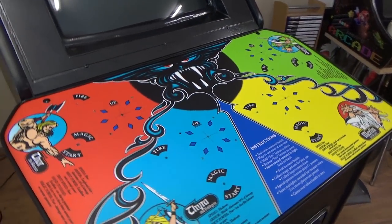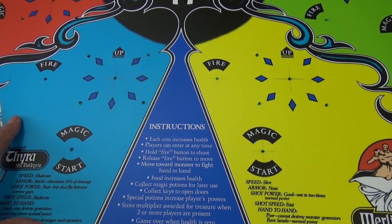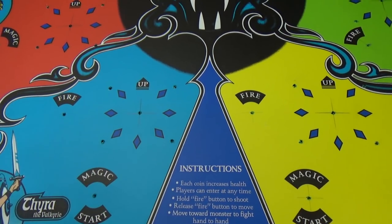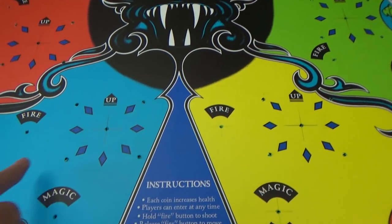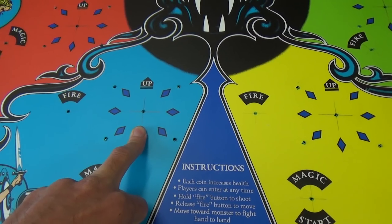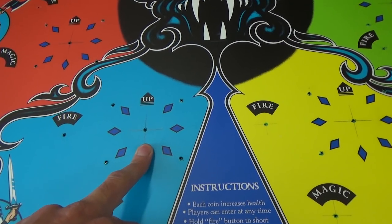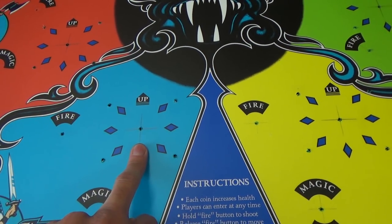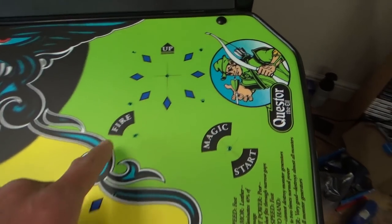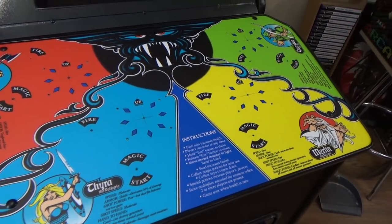But for now, I want to just flick the lights off, and I put a light inside this cabinet, just to highlight where the holes are. We're going to have a little look, see if we're in the play area, because again, another little minor mistake. I used the 44mm hole cutter. And if I had to do it again, I probably would have used a 40mm, because you do gain a couple of millimeters when you actually cut the hole. So I've gone over the 44mm. I'm probably about 45-46mm on the hole. So we are sort of close to the edge. But anyway, it is what it is. We're not too bad. So let me turn the light off, put the light on inside, and we can take a little look.